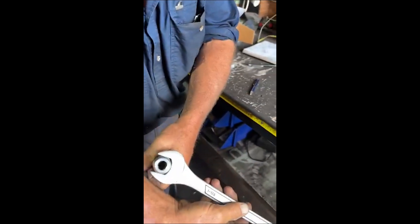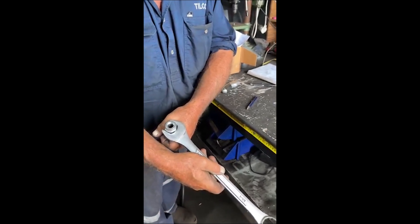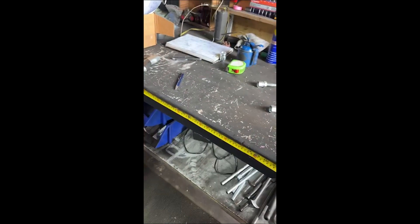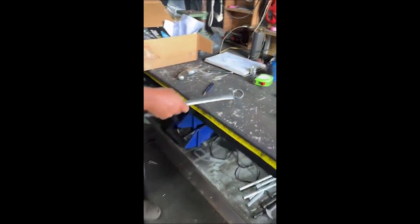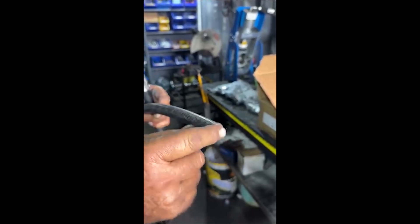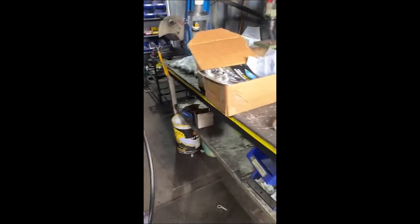You just pull and it pulls up. We should have prepared the end of that first, right? No, you don't have to worry about that — it's all cut off. You don't have to get the pipe end perfectly cut, no. Just cut it off — as long as it's a parallel cut. I think the spec is about one-point-something millimetre deflection, so it doesn't have to be perfect. Just use the drop saw.